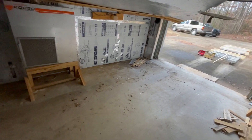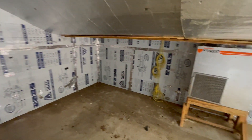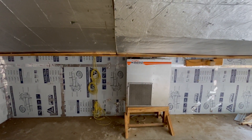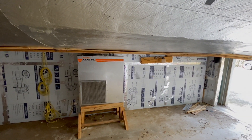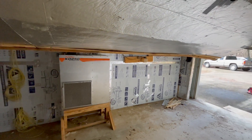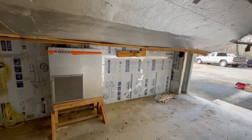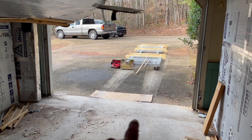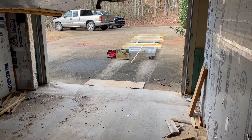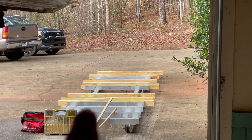This is a little wider than most kilns that use this unit. I originally planned a six-foot wide cart, but that turned out to be a mistake — it was too wide. The cart I built out of big thick timbers warped on me after the fourth run; the heating and cooling cycles just destroyed it. Now I have a cart that's only four feet wide, which is a little narrow for this space, but it still works great. I added some three-by-threes so sometimes I can put in a stack that's five feet wide, which increases the total board footage inside the kiln.